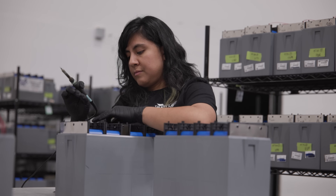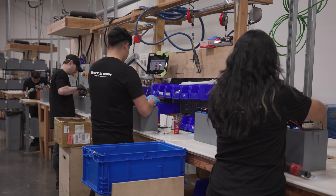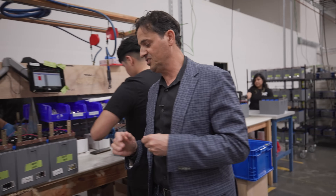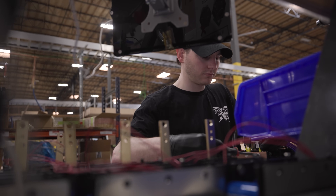The sensor wires are soldered on. The modules are bolted together in series, either four for 12 volts or eight for 24 volts. And then finally, we mount the battery management system along with all the other current carrying metals, the brass and the copper.